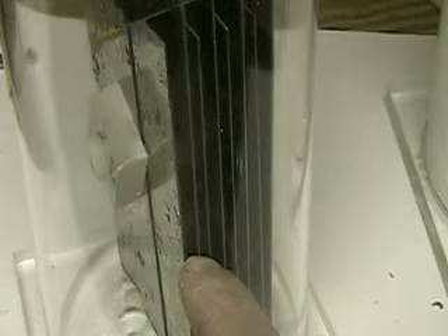The plates on all of my cells have been one-eighth inch apart. The way the formula works, which explains a lot, is you take the area — that means all of the plates together — and you take the space between the plates, and then you take the electrolyte and the temperature of the water. The smaller the plate area, the closer the plates have to be together.